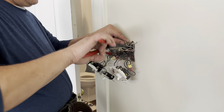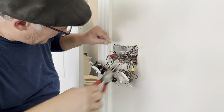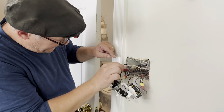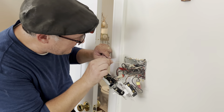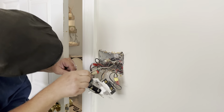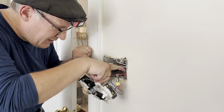Eric, how many homes do you think on average have this issue? About one out of every two homes I go into has some sort of wiring error. Neutrals from two circuits connected together I don't see that too often — we do 150 houses a year, and it's probably one out of every 10 houses, maybe.